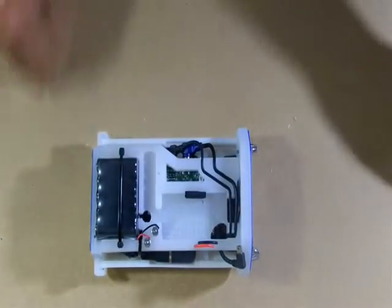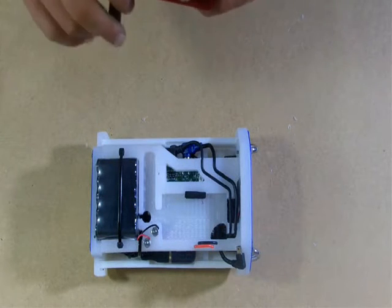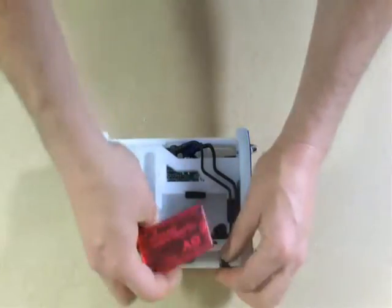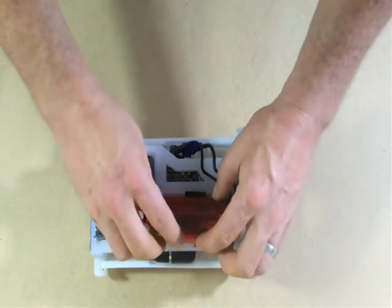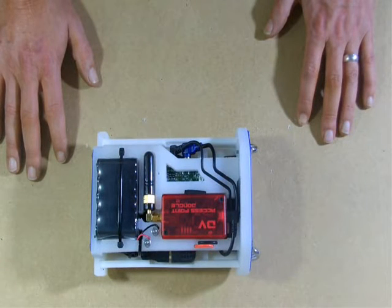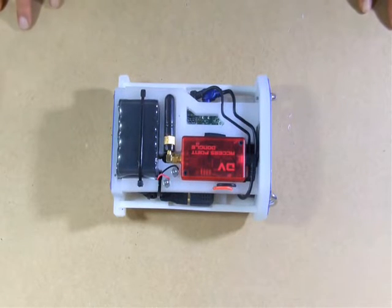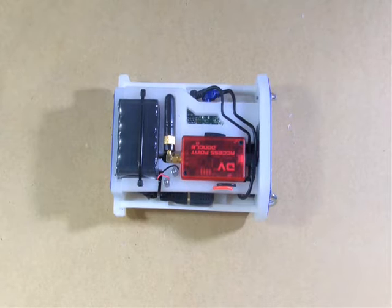Let me think — remoting the antenna, the worldwide charger, how to put the DVAP in and out, the keyboard operation with the little monitor. One thing that's kind of neat is that because this is a native 12-volt system, within reason you can charge it or run it off of a vehicle. It's a nickel metal hydride battery, so don't go crazy leaving it unattended if you're charging it that way. In theory you could shorten the overall cycle life of the nickel metal hydride if charging it with something other than a voltage intended for nickel metal hydride — but when you're in the field and need to make it work, you make it work.